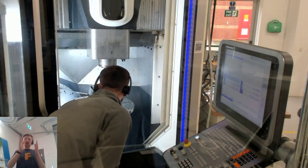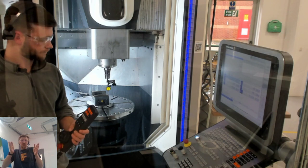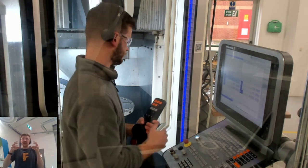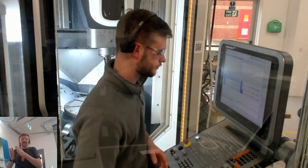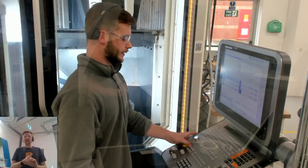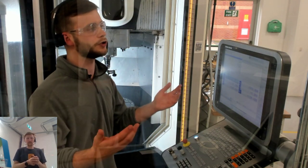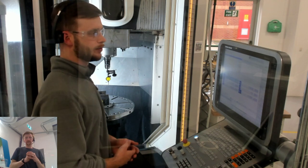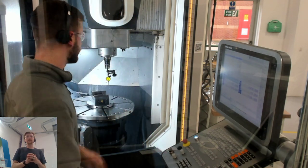We can't see the needle, of course, but we can see the whole point of it. Dylan is going to look at the needle and go, right, I started at zero, I have now moved across, and let's say it's reading 10. He's now going to adjust that rotationally using his extra axis or knock it with a hammer. So when he goes from left to right, that needle does not move, or moves so little it's acceptable. It's kind of subjective, in how good you think good is. What do you find acceptable? I'd say if you're within 0.02, that should be good enough for most applications. But obviously, I can't speak for everyone.